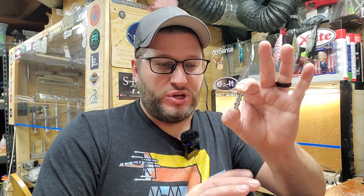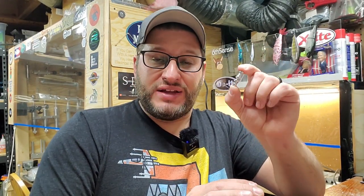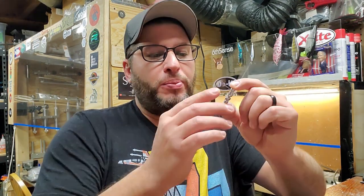So we're gonna make a couple of these tonight, and I'm gonna show you, with these inserts, you cannot just put them in the mold and pour the plastic in there, because if you do that, the plastic actually will corrode the lead. It actually makes it get all nasty and it looks terrible. So what you have to do is you have to seal these. Now, you could either seal them with a clear coat, which is okay, or I can dip them in a powder paint and heat them up and get the powder paint stuck to them. That'll give it a nice clean finish. That's what I'm gonna do.